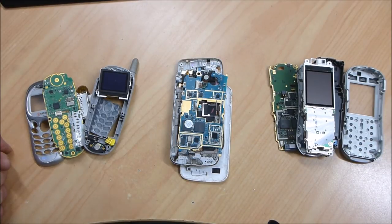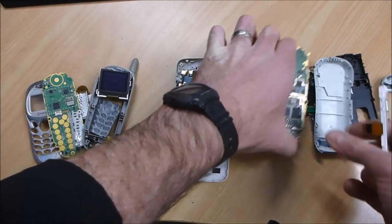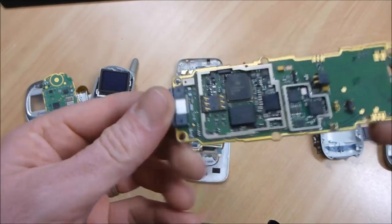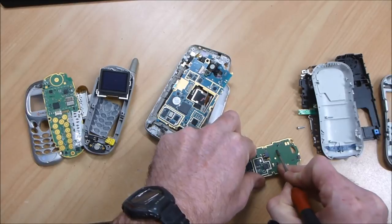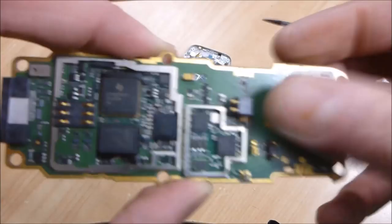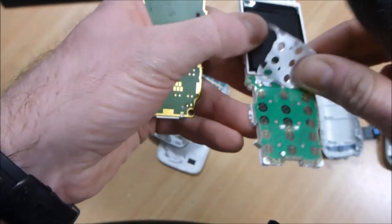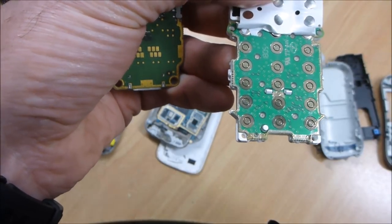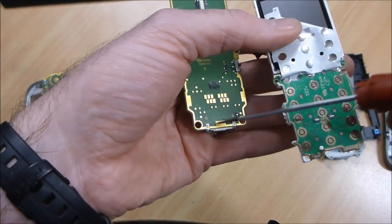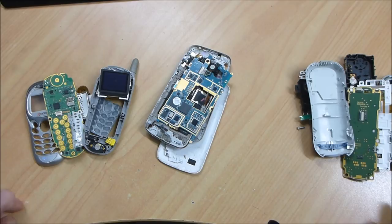The third phone is a SageM - I assumed it was fairly old because it doesn't even have a camera on the back. The control board we're fairly sure is all ENIG - I'll scratch that just to see. Yeah, that one's also copper underneath the solder mask. But the keypad board is a completely separate board and doesn't appear to have anything soldered onto it, which means there is a chance this stuff will be hard gold. So I'll test that in conjunction with one of the pads from the main board, get these chopped up and under the microscope.